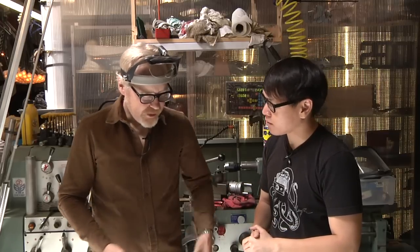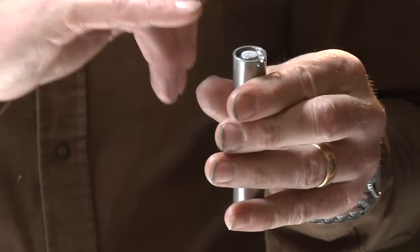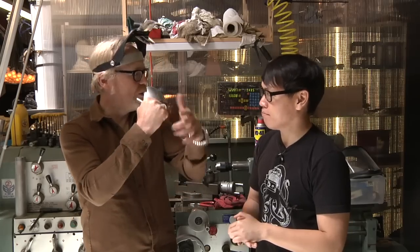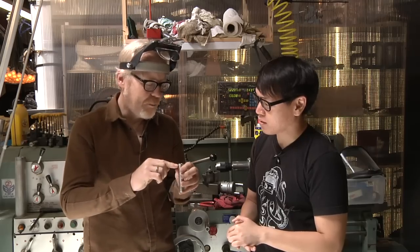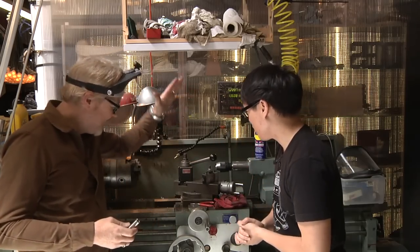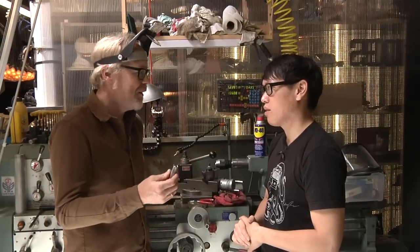However, in pulling it out of my pocket and using it, it has a recessed button. I don't like a recessed button, I like a proud button. In engineering, when you have something sticking up over another thing, you call that proud. I want a proud button, so I'm going to use this beautiful machine here, my tool room lathe, to modify this flashlight and make it better.